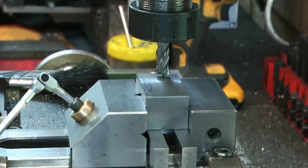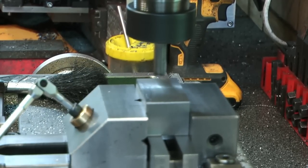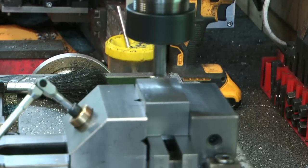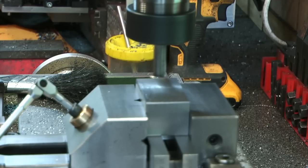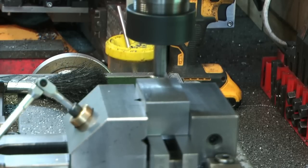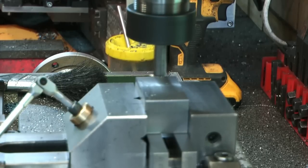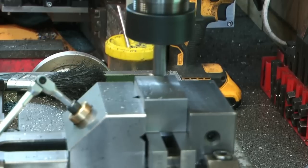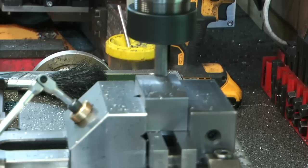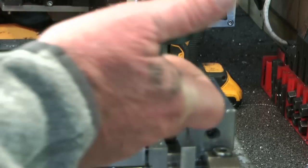I think we'll slow that cutter down a bit. Come off the job. Let's say 1mm at a time - could probably do more like 3 or 4mm. I'll run a mil cut, turn that feed down, turn the feed on. I'm going to run these down to maybe 12mm depth, and then we'll do the step-overs - I'll step over towards the bottom until I get a reading of 6mm thickness on the bottom rib.